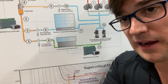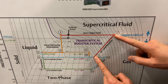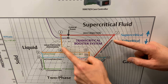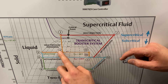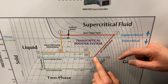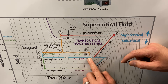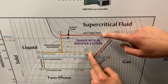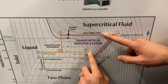Let's take a look at the enthalpy diagram here. If we look at the medium temp compression, we have one to two — and this would be the three 15-horsepower compressors — because we're taking all this load from the flash gas. Here's your high pressure valve, dropping it out of the transcritical range and back into the subcritical zone. Here's our flash tank or receiver, and here's our bypass right here. So we're bypassing all this — say at 34°F — and then we have to drop it down to get into that medium temp suction. But with parallel compression, instead of bypassing it and dropping it down to 20°F, say 400 PSI, we will now go from here — which is point 10 — and use the parallel compression to pump and do useful work, pumping from 34°F instead of going down to 20°F.